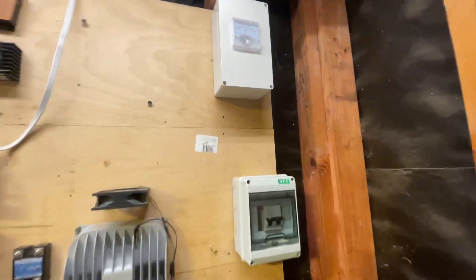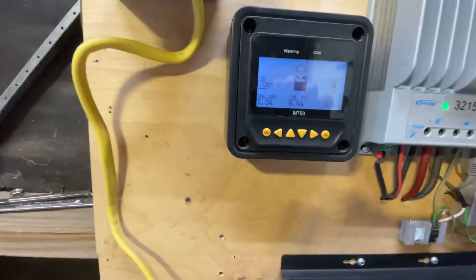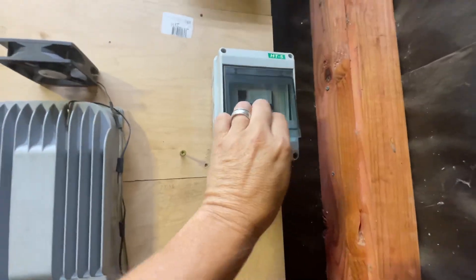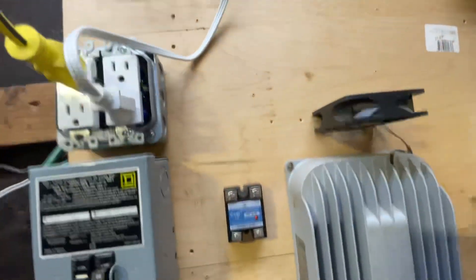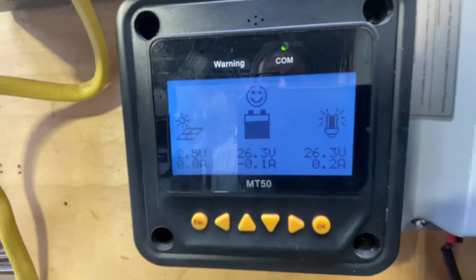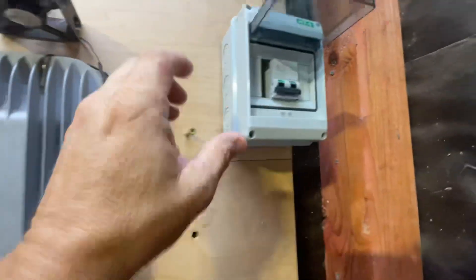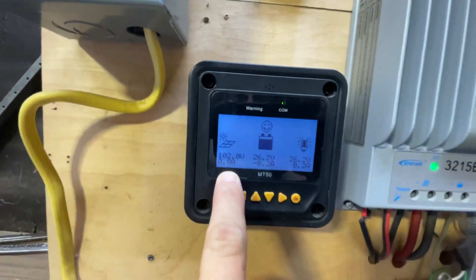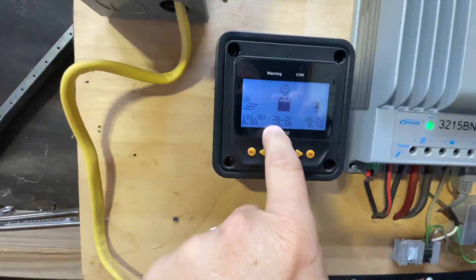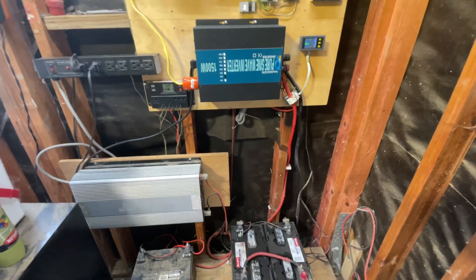It's just there for looks — I can look out the window and see what the wind speed is. That's a voltage meter showing the voltage coming in. I've got this breaker here that separates and shuts the solar completely off. You can see 86 volts coming in right now. I flip that breaker off and the panel voltage sits at about 100 volts — and as you can see it's dead, nothing coming in. I'll turn it back on and you'll see it peaking up about 102 volts, then it'll start charging again.